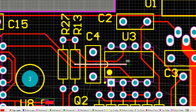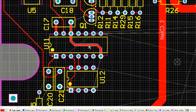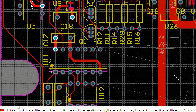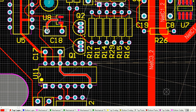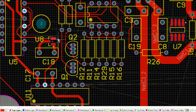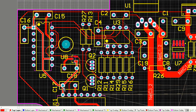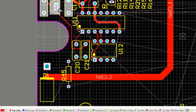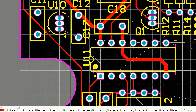So I don't want to have them on the opposite side of the board and run traces all the way across, and it can cause all sorts of issues with ground noise and EMC and all sorts of stuff. I don't have the capability to go into all that detail today. I'll have to do separate videos on each element of PCB design. This is just me giving you a general overview of what I'm thinking about when I'm laying out this board.